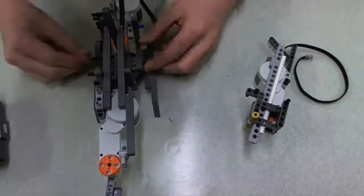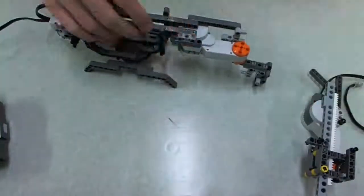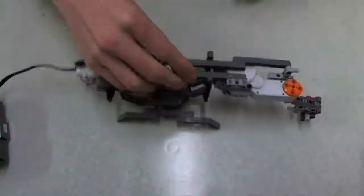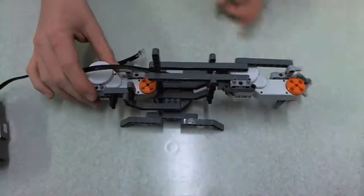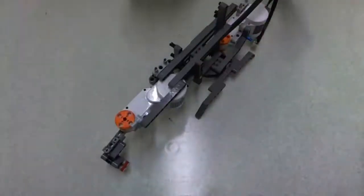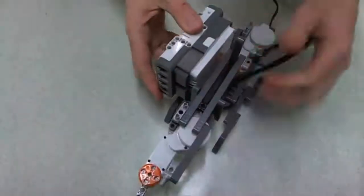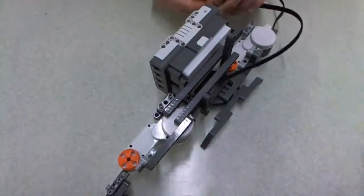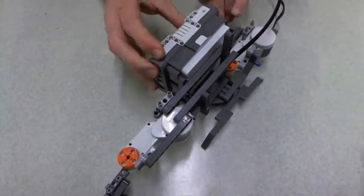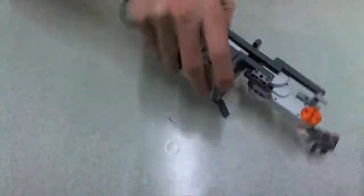It's all held together and it's quite sturdy. You can see some resemblance of a robot sitting there. That's what it is — revolute, revolute, everything. The pen doesn't hit, and the NXT quite ingeniously just goes straight onto the side there. Plug your two motors in — just to keep the numbering normal: second joint to port B, first joint to port A. Keeps your program simple, and that's a robot — that's how you build it from scratch.